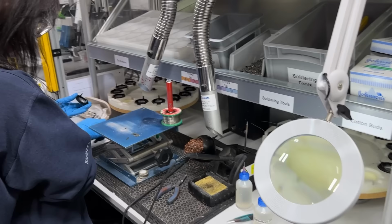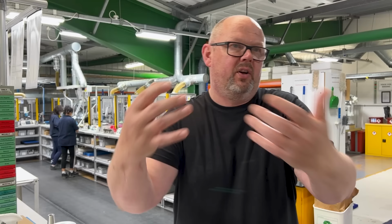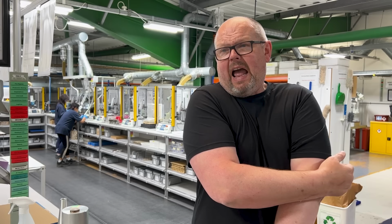Essentially by using a light, highly stiff material, we get a dome that ideally stays in shape rather than bending and flexing and distorting, and it pushes away the first breakup point to an incredibly high threshold. This is getting to around 70 kilohertz, 72 to be precise, and that means, in theory at least, very benign behavior within the audible range, which is the reason why we did it.